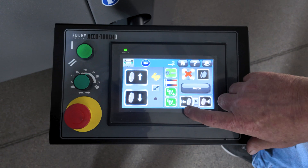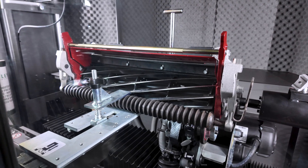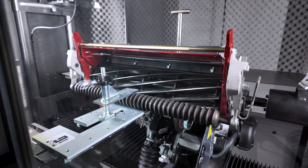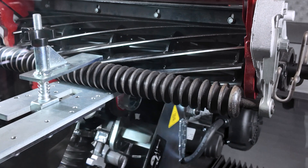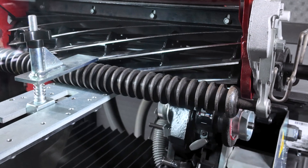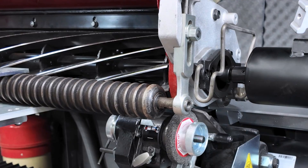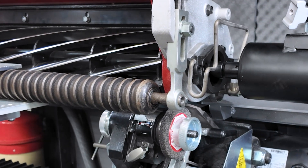Use the manual traverse icon to traverse the grinding head all the way to the left. Watch for proper clearance between the grinding wheel and the reel blade. Check for proper clearance between the index finger and the front side of the blade on the return trip to the right proximity sensor. Also verify that there is enough clearance between the fingers of the reel blade and spiders.